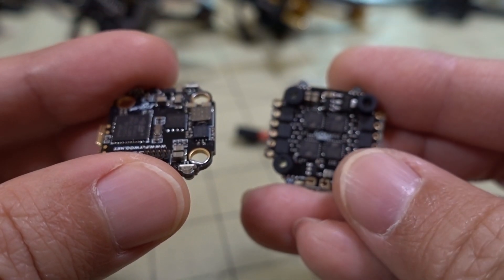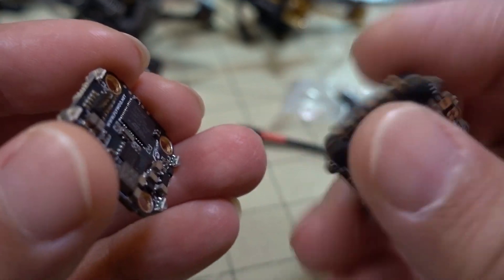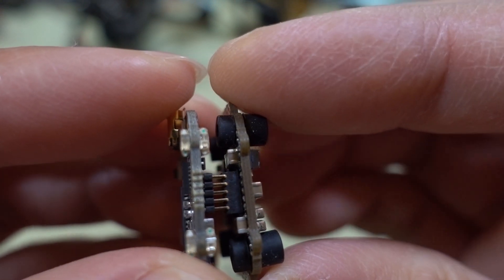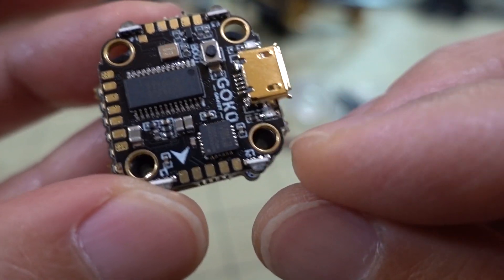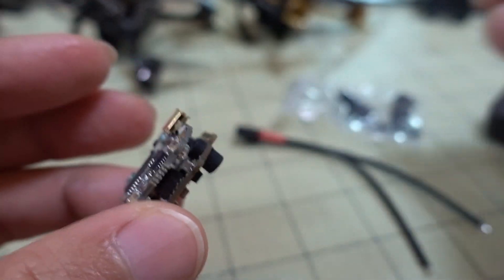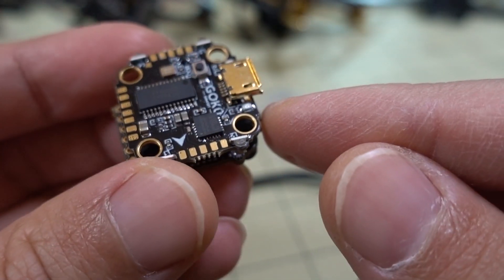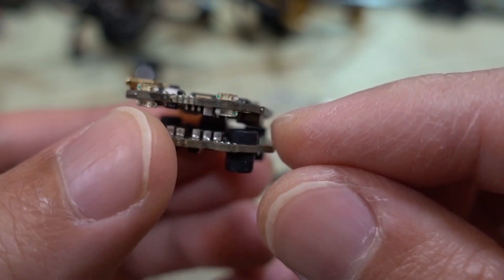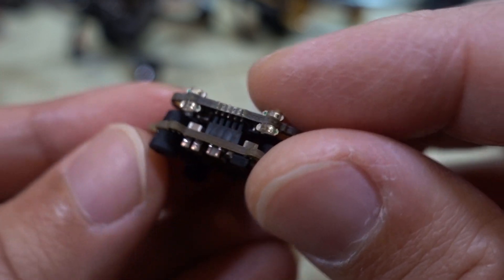You get the 4-in-1 ESC and the flight controller. As you can see, this has pins — some of you who don't like pins won't love this one, but they come with steel screws so the chance of breaking is not super high. There's an M3 hole for the flight controller and likely the same for the ESC. There don't appear to be rubber grommets in my sample, but in the product pictures there were — so you should get those, and they'll keep the spacing constant so the boards don't put pressure on the pins.